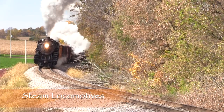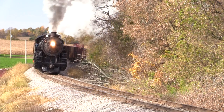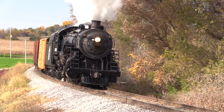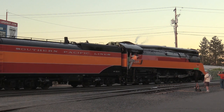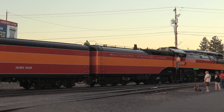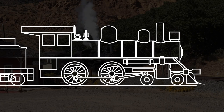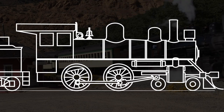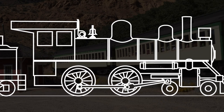You never want to use the twist method to re-gauge steam engine drivers. Let me say that again — never use the twist method to re-gauge steam engine drivers. Always use a puller. The reason for this is geometry. The crank pins on steam locomotive drivers are usually set 90 degrees apart from one side to the other — this is known as quartering. Whether it's actually 90 degrees or something else, it's vital that the angle is exactly the same on each driver. If it's not, the distance between the crank pin holes as the drivers rotate won't be constant. Since the side rods have a fixed length, if the engine is out of quarter they will bind and the locomotive will run badly or not at all.